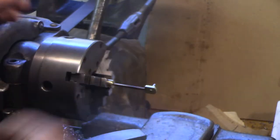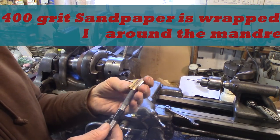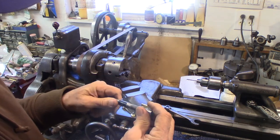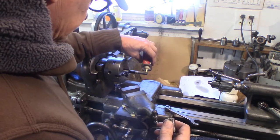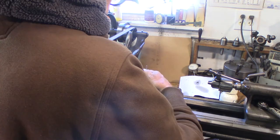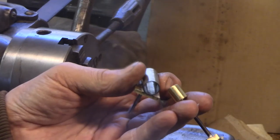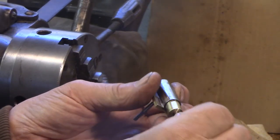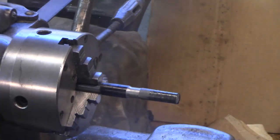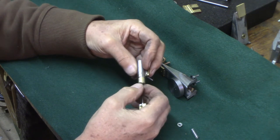It's real nice. I made this mandrel — slightly less than the diameter of the cylinder. I'm going to chuck it up in the lathe and spin it while I'm holding this. I've got dry sandpaper glued on it. I've got the piston fitted. It's a little tight, but that's what you want, and then I'll let it work itself in with a lot of oil.